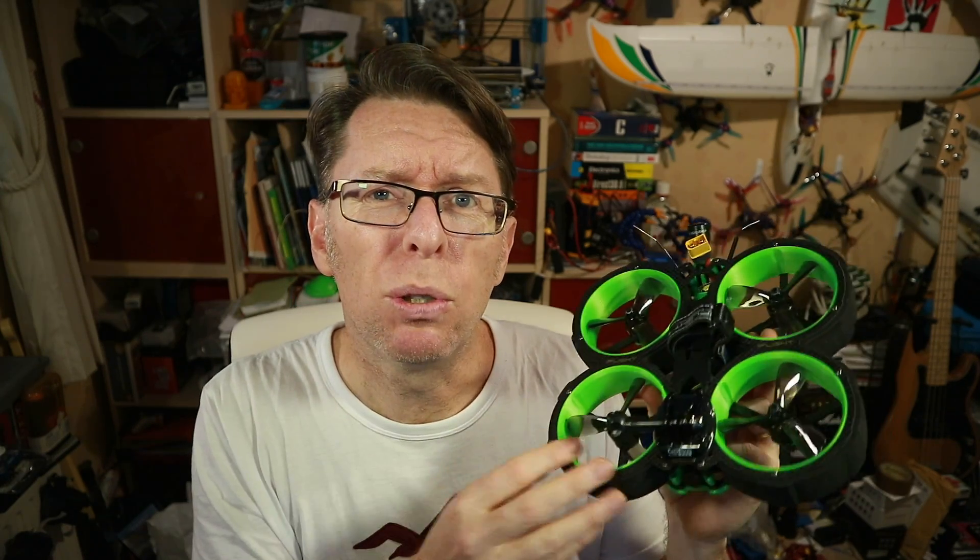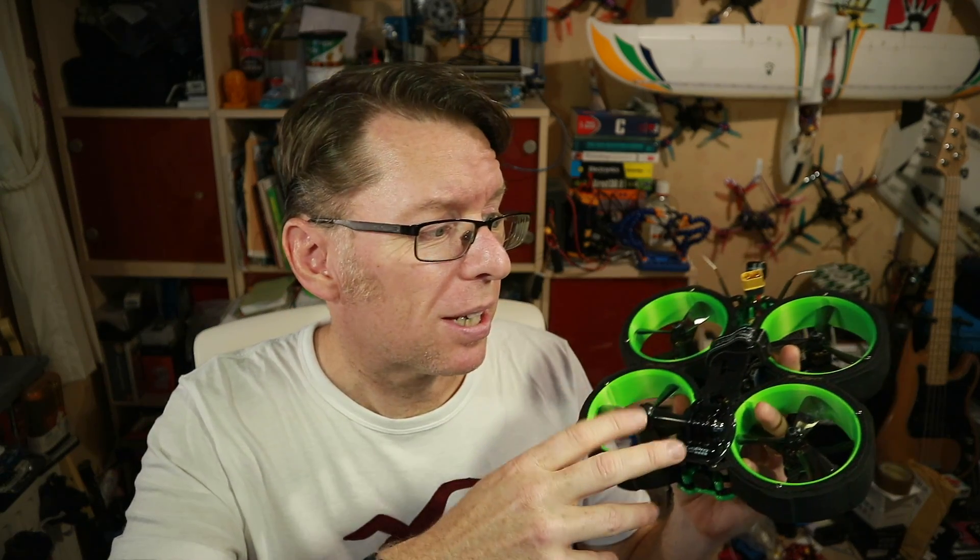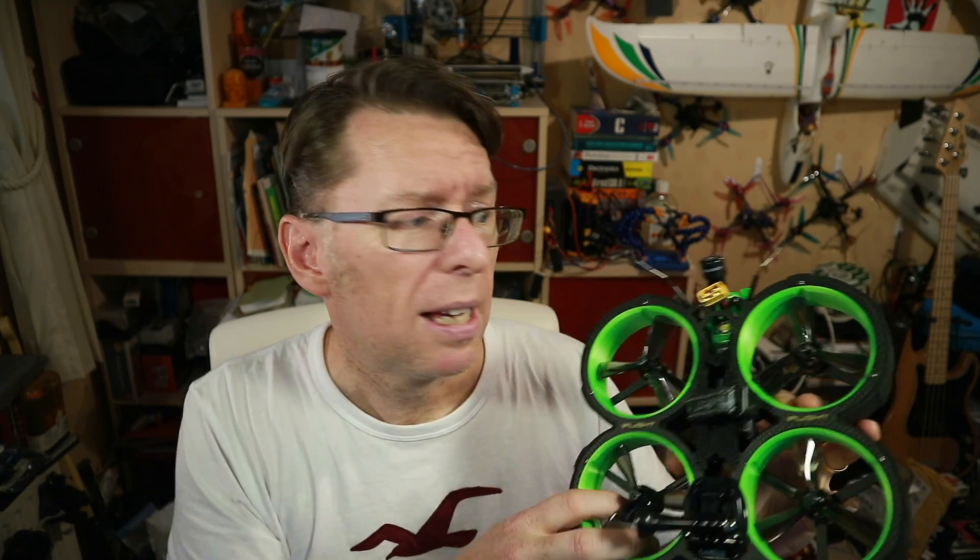So finally it's fixed — it's working okay, doing what it should do and not overheating. One really crucial thing to talk about when flying any CineWoop is weight. You wouldn't really put a big GoPro on a tiny three-inch quad, and what you're doing here is asking a three-inch quad with more around it and more weight to lift up really inefficiently — so these things are really on the edge. The most crucial thing is to keep the weight down, and this means the LiPo. As much fun as it is to get a longer flight with 1800s or even 1550s, the 1300 ran cool and I wouldn't go above that — just take shorter flight times and bring more batteries.